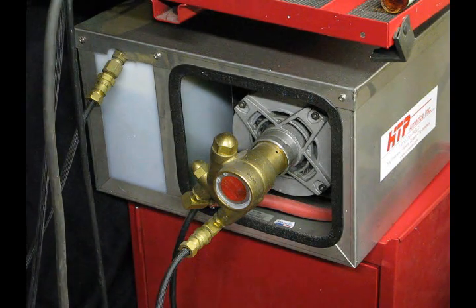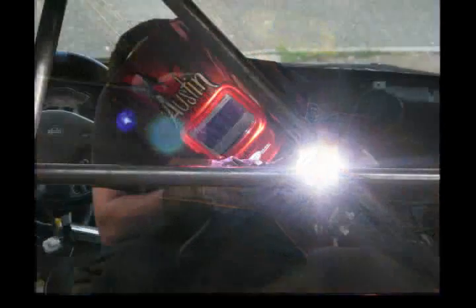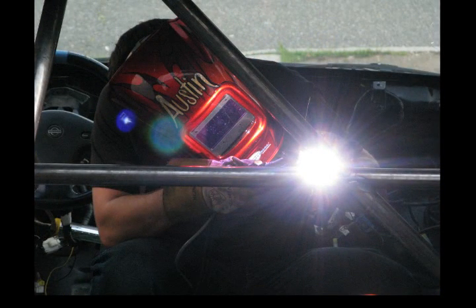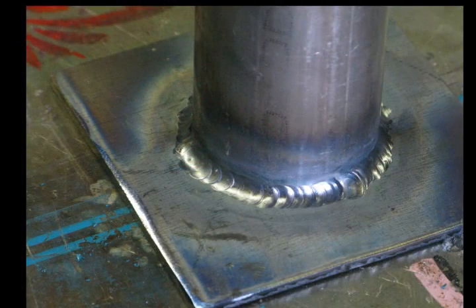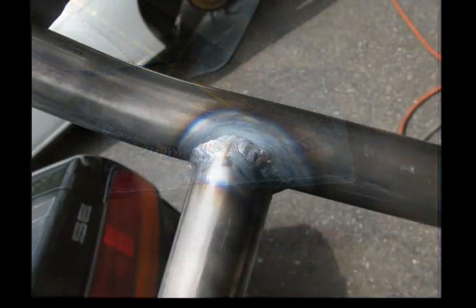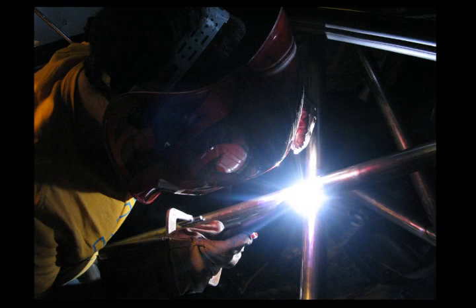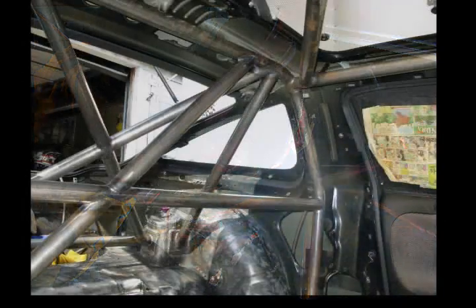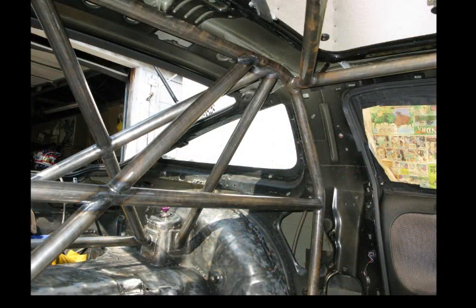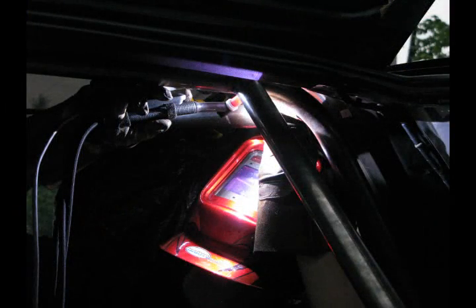For the small amount of money additional that a cooler is going to cost you, it's really going to improve everything about the whole TIG welding experience. And in particular, HTP's cooler is designed to work directly with the 221 — it's not some kind of cobbled together piece. It works, it plugs directly in. As you can hear, it's running — it's extremely quiet. It's got a solid brass pump, so that'll give you years of service. And it's a 2-gallon reservoir. The leading competitor's cooler is a 1-gallon reservoir, and in order to upgrade to 2 gallons it'll cost you a significant amount of money. You get 2 gallons right out of the box with the HTP cooler.